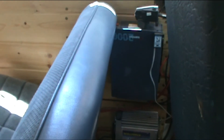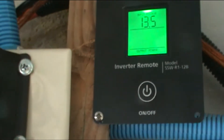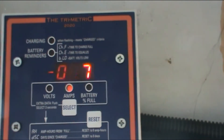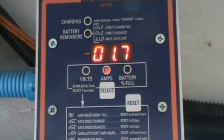If the bus is not hooked up to shore power, I can also generate AC electrical using this 2000 watt Samlex inverter. This is a pure sine wave inverter, so it costs a little bit more than a square wave inverter. Some devices don't care and others do. I need a pure sine wave inverter because I have a laser printer and some other stuff that wants it. I can turn the Samlex on with this remote up here. Now it's running and all the outlets are now energized. You can see the Samlex with no load on it is already using almost two amps. So you want to avoid using AC if you can, because it's not as efficient as just running straight off the battery.